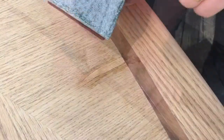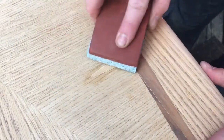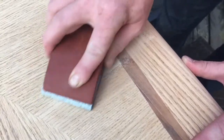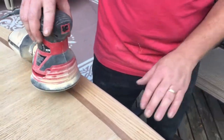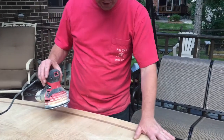With a little sandpaper on a block, now that this is dry, I'm going to come in here and sand this until it's flush. I'll touch it up again with the random orbital sander at 220 grit, and we are ready to put on the finish. That came out really nice - the color is a little different but it's gonna turn out very nice once we put some stain on.